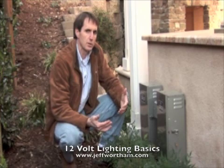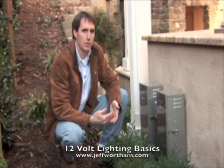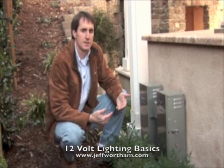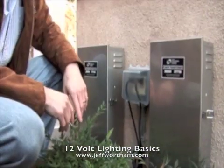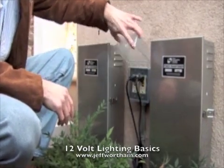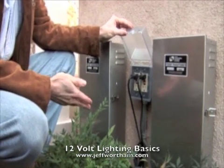The way we do this is we have an electrician come in and provide 110 power. That power needs to be inspected — that connection needs to be inspected by a city inspector — and then it comes here to the main power source. The electrician will bring power to this box, which is a waterproof GFI power outlet.